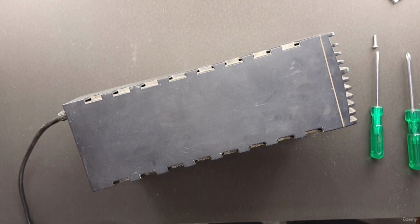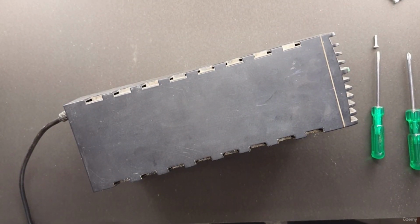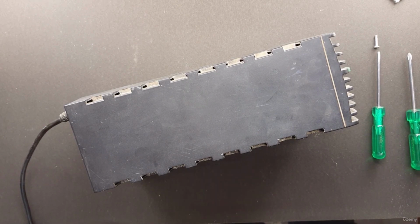Now, if everything fits together well, you should be ready to fire up the unit and consider your repair complete. And don't forget to test everything. Be sure to bench test heat generating products if the work you did could possibly make them run too hot. It could have other problems like buttons that do not work because they are not lined up properly with the board. Test every button and every function.